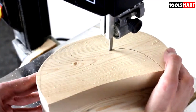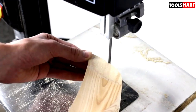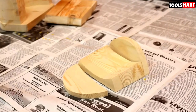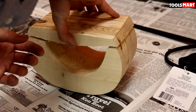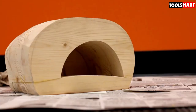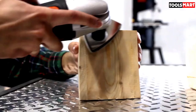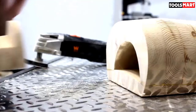You can fit your wood piece quickly to get resawing done in no time, and it can also assist with book matching. It offers two speed levels — 1520 sFPM and 2620 sFPM — helping meet demands for varying projects. Its 3.5-amp motor delivers enough energy for heavy-duty performance. When cutting different materials, you can change blade sizes from one-eighth of an inch to half an inch.